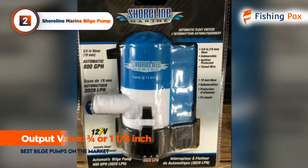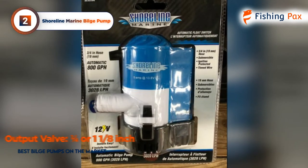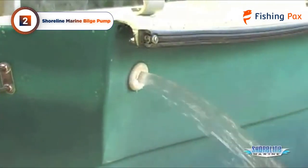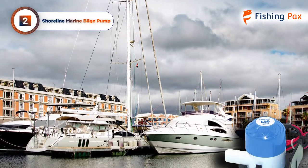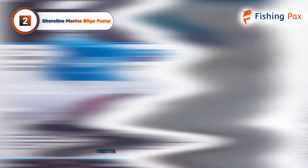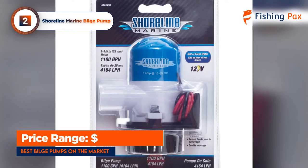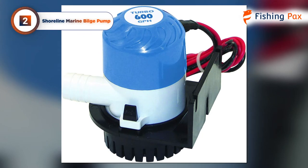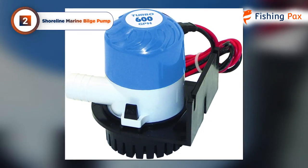It shouldn't leave more than about an inch behind. For some additional peace of mind, this pump has been rated ignition protected, which means it won't ignite flammable gases if any are present in or around the pump. At just 4.5 inches tall, this pump will fit just about anywhere you need it. The universal mount means you can place it anywhere in the bilge — just make sure you pair it with a float switch, and take care to put it somewhere its relatively low power can still get water up to and past the discharge point.